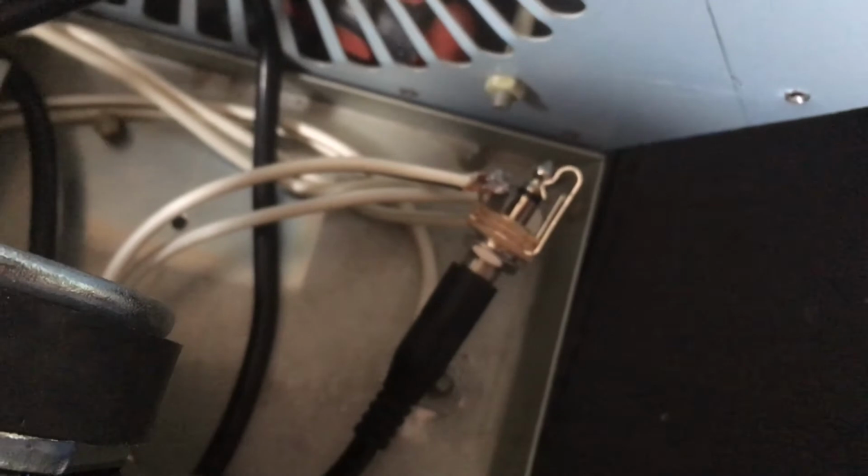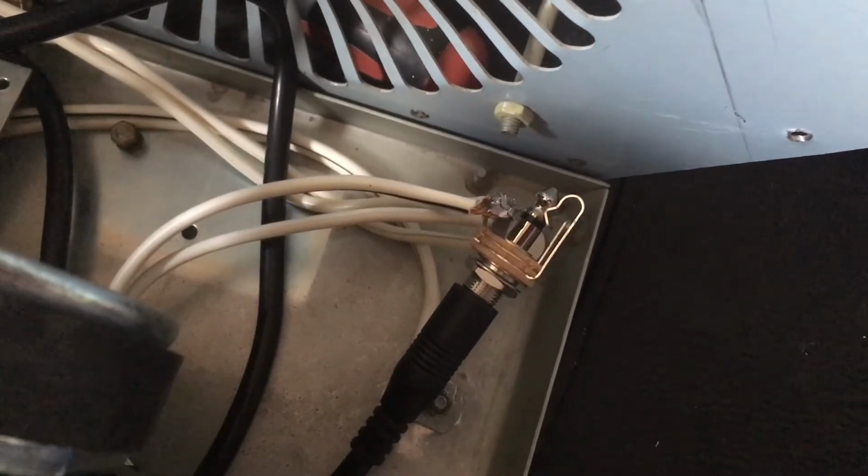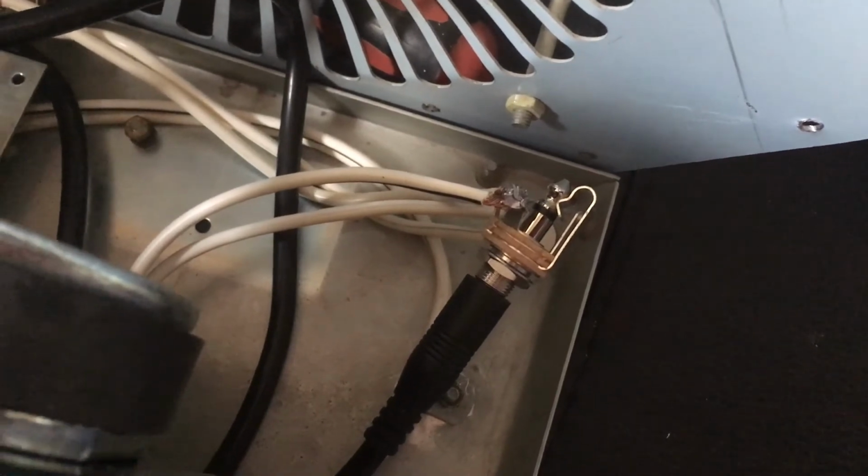Notice here the extremely stupid mistake. I didn't put any insulation on a steel chassis. When I turned the amp on to test it, the speaker started making a pulsing popping noise. I realised something was up. I switched off the MV50, removed the speaker out jack and tested it again. Now it sounded fine.